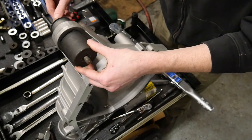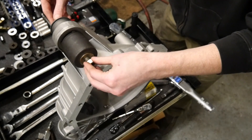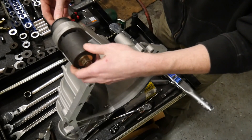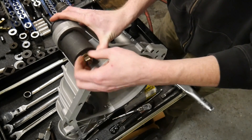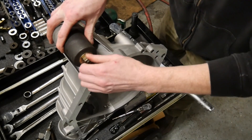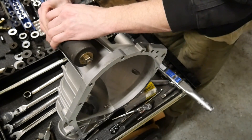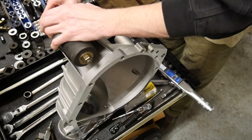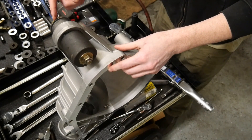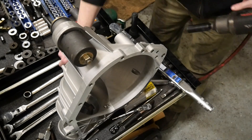This one I used on the other side worked out perfectly. It's a half-inch bolt with a half-inch socket — fits just perfectly. Put a washer on the backside, get the nut started, and snug everything up so it's in the right position and the socket doesn't shift or the bushing starts going in crooked. Once finger tight, start to snug and make sure you move the washer on the back side so it's nice and centered. You don't want it pulling through off-center, otherwise it's going to dig in and push the rubber outside of the sleeve.